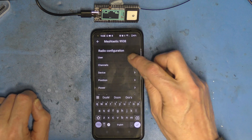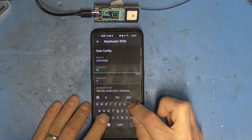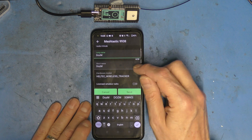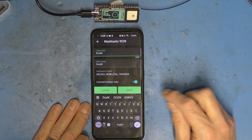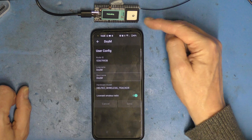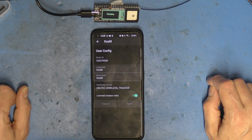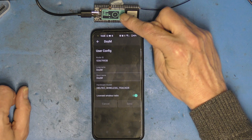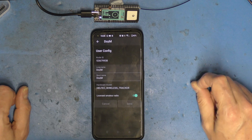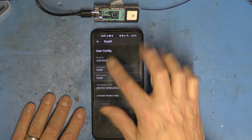We're reading the configuration and we need to change the name. I actually want this to be DOS-M, for mobile. You can call it what you like — there's no particular protocol. Click on the three dots, go to Radio Configuration, and change the long name to DOS-M; short name can be the same. I have an amateur radio licence. Hit the Send button — delivery confirmed. When you set these things it often does the rebooting procedure again. It's already telling me it's picking up Cheltenham East, which is the node I've built that's outside on the mast. That's all good.